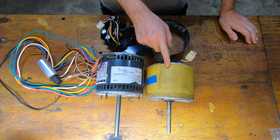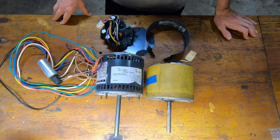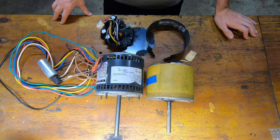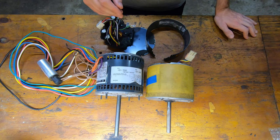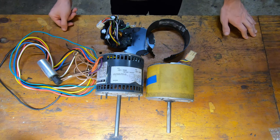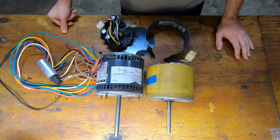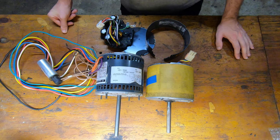The original motor has an advertised half horsepower and 1,300 RPM max speed, but I never ran the fan wide open anyway, so I'm not concerned about the difference in top speed. What I'm a bit concerned about is if I picked the right power rating or if I should have sized it up or down relative to the ECM rating. And I'm not sure how much difference we'll see between the speed settings, but there's only one way to find out.